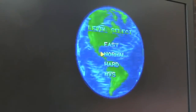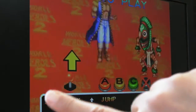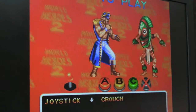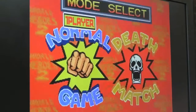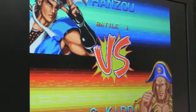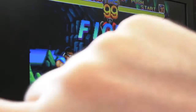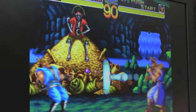So that has solved the problem I was having with that. Just start this - just make sure it looks alright while it's playing. You see that? Total straight - this edge here is just straight all the way down, and it's the same on the other side. There's no distortion or anything going on that there was previously with those 100 microfarad caps. Previously there was loads of wobbling, and even sometimes on the main game screen here as well. But it's looking sweet now.